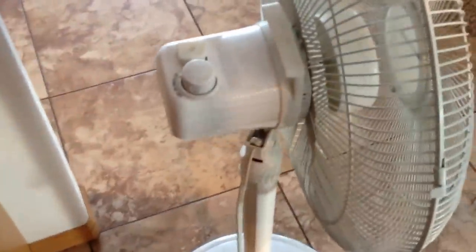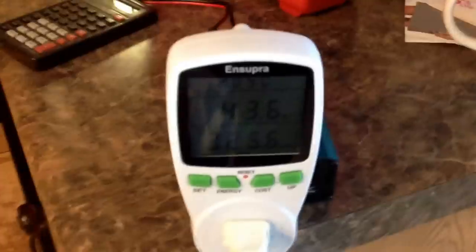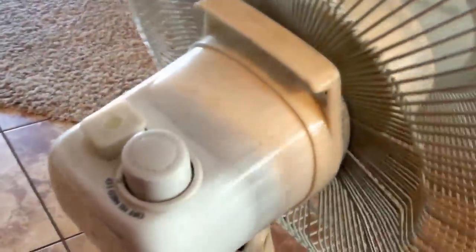Here's an example of the fan I've got running right now — it's taking 49 watts at 120 volts. So it's running off the modified, but I don't know if you can hear it, but it's making a humming noise. What will happen is eventually this will heat up and it could burn out. In an emergency it would be fine if you're not running it too long. Now I'll hook it up to the Pure Sine. We have the Pure Sine inverter hooked up — this fan is running nice and smooth, no humming noise, so it's not going to burn up the motor.